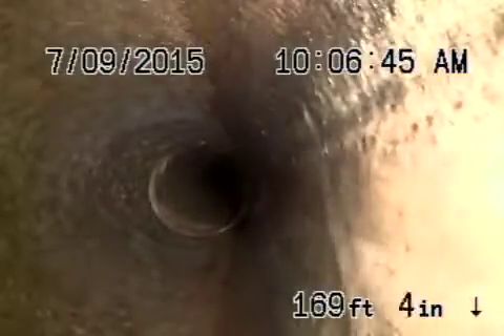Bringing it back — the clay pipe we're in right now all looks like it's in fair condition. You can see there are some minor cracks at the hubs that we saw. No serious problem really. Looks nice and clean coming back; we ran a lot of water down and the water was draining pretty well. Coming across that back property, all clay, which looks pretty good.